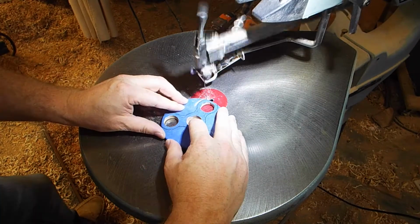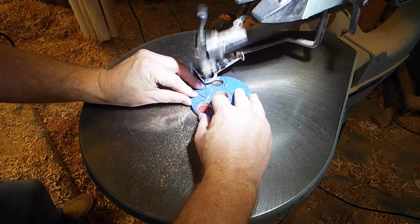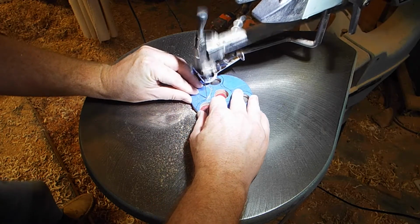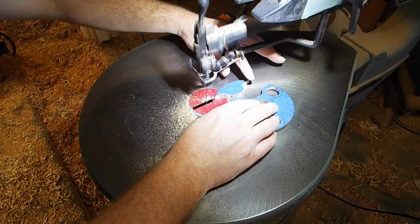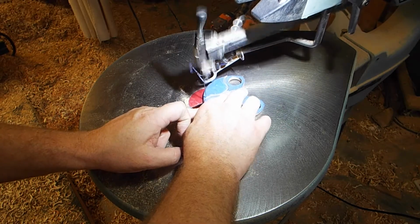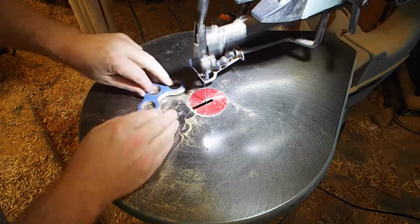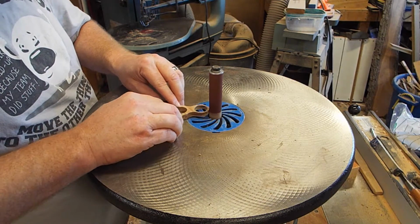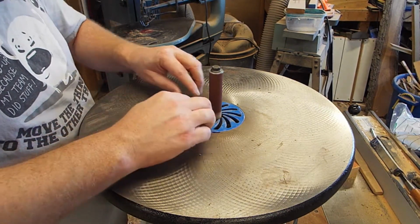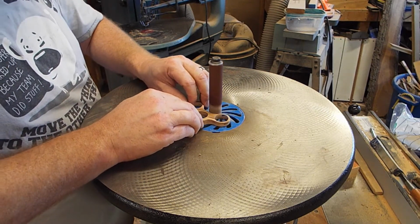The next step is to remove the excess wood at the scroll saw. This part may have been made a little easier without the gentle curve on the faces of the body. I followed up the scroll saw with the smallest spindle to clean up the cuts on the scroll saw and do some fine shaping.